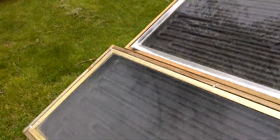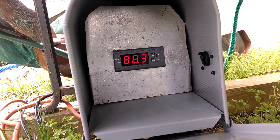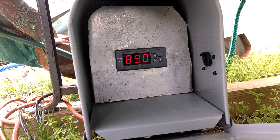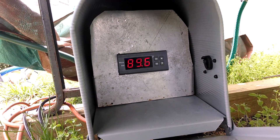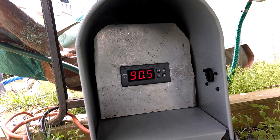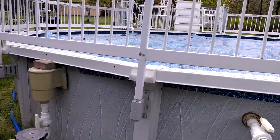It just kicked off. Here you can see the solar panels went down below the set point, which was 100. This 54-degree water is pumping in. It's moderately sunny, but you can see the temperature increasing internally on the panel. It's between two of the pipes inside on one of the larger panels at the tail end, so you're flushing all the hot water through the pipe. There's a set point of 100 with a hysteresis of 20, so it goes to 120 and engages the pump.